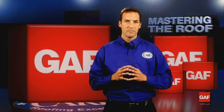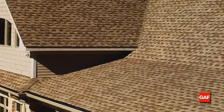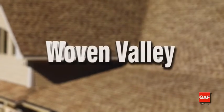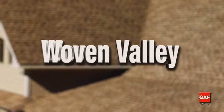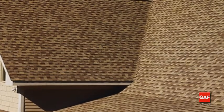Remember, valleys are a prime leak area, so it's important to be extra careful. That's why we require the use of Weather Watch or Storm Guard self-adhering leak barriers in all valleys to qualify for the Golden Pledge limited warranty. The woven valley is a very waterproof valley because it leaves no exposed openings and because the 2 sides of the valley are usually blended together seamlessly.